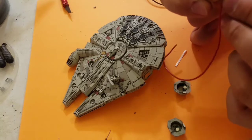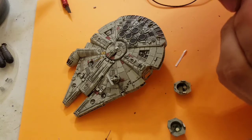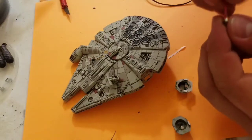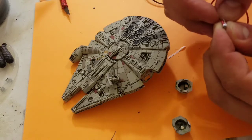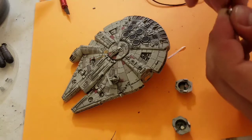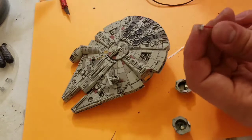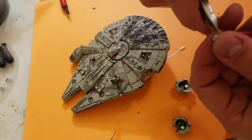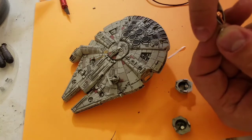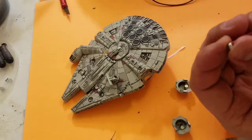Once we have it on one surface, we will then wrap the wire over it and then wrap the aluminum tape around the entire magnets again and wrap the wires back over top a second time. At the end of all of this, we can trim off any excess wire and then bend the wire itself to be at 90 degrees from its current location. This will make a strong area to put the green stuff onto.